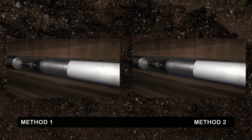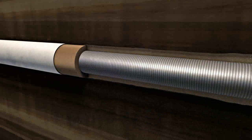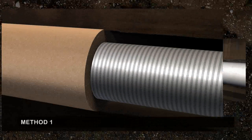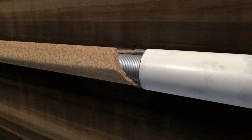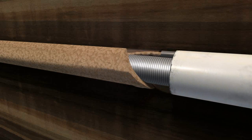However, if the soil composition is not consistent, then it is necessary to opt for an artificial area filter. There are two ways to achieve this. The first method involves equipping the filter tube with an artificial area filter beforehand. The soil then sinks onto the area filter when the pipe sleeve is removed. The second variation involves fitting an interior support pipe in the pipe sleeve. This extra pipe installs the artificial area filter when the pipe sleeve is removed. The soil once again subsides and the filter system is installed.